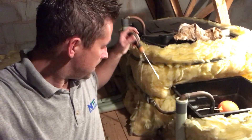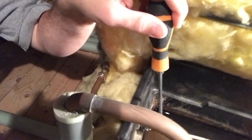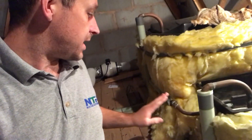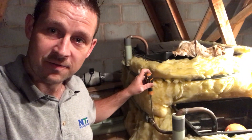So here we've got this isolation valve just here — it goes along and feeds this float valve. I'm just going to turn that off. If you haven't got an isolation valve upstairs, you need to go to the main stop tap and turn the water off to the whole house, because the water from the stop tap will go in many directions but it will also come directly upstairs to this point. So just to reiterate: if you haven't got an isolation valve, turn the main stop tap off.